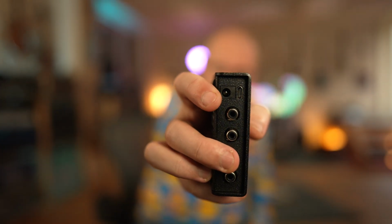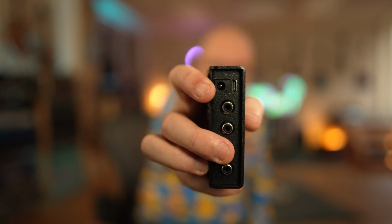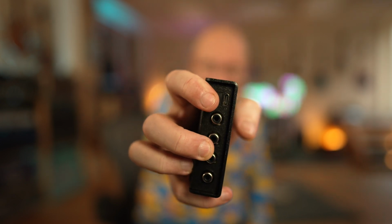So you have this relatively tiny, really well-built power supply, which gets its daisy chain input right there, or the direct input from the power supply if you're getting the full box. But it also has a USB-C input. Yes! That's interesting because it can take 5 volt input and it converts that to 9 volt on 4 outputs. Each of those 4 outputs, again, switchable from 9, 12, 15, and 18. Each 660 milliamps. So this is a very small, massive powerhouse that can be off-grid with a power bank.